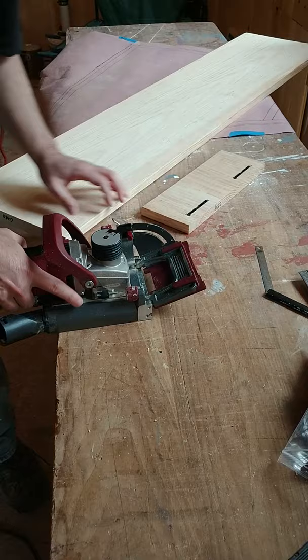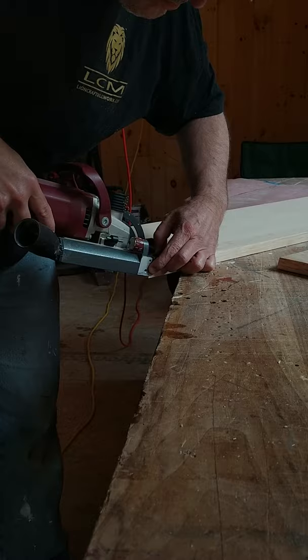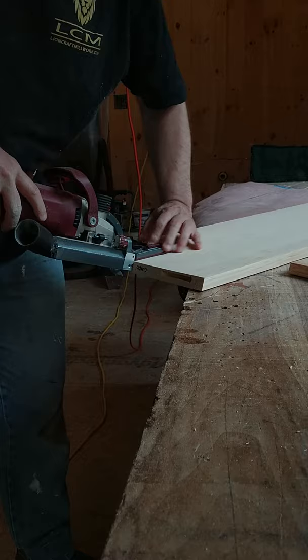Here's another example of where we're going to use the 4 millimeter spacer plate — it comes with every Zeta. You put it onto the flip stop and now my cutter is going to be closer to my short point so I don't blow off from my long point.